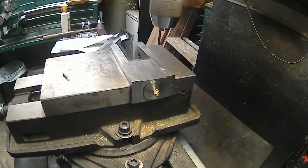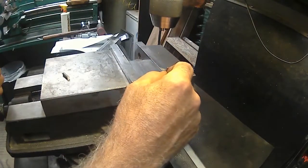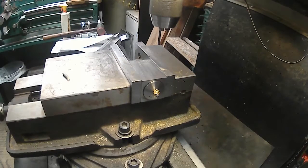All right. I'm going to do a small drill. And I'm looking for a small carbide drill, one that won't deflect. I don't have a center drill to go down into there. And if I go in there without, it's going to deflect off that hole, and it'll go up against the edge of the hole.